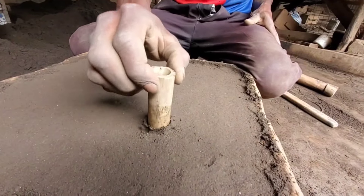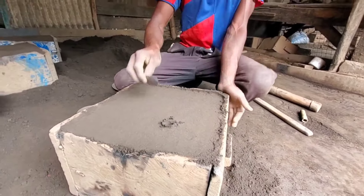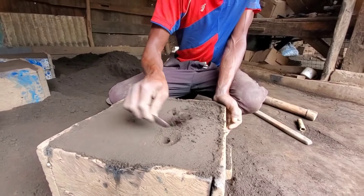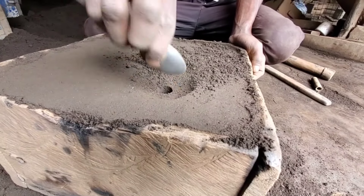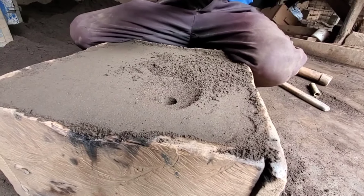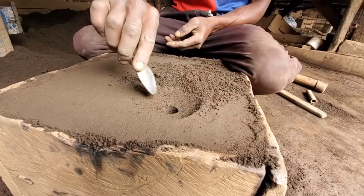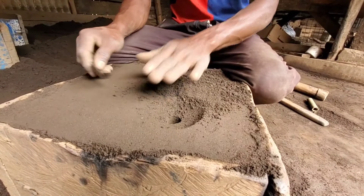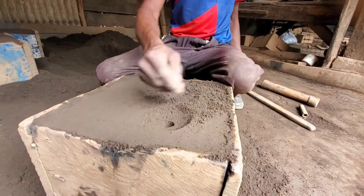Now we remove the pin to leave the hole. I've seen that the other side has two holes — one for breathing and one for pouring in. For these small saucepans, we put one hole. When we pour the melted aluminium here, it goes down the slope. If it were flat, the aluminium could pour aside. But with the slope, it goes straight down — that is the use of the slope.